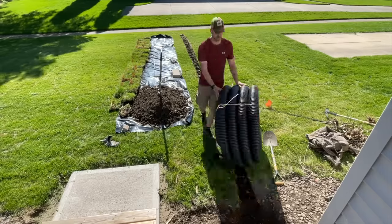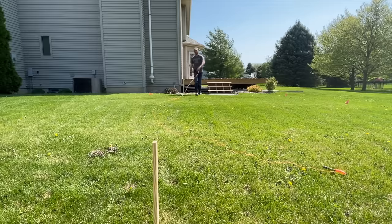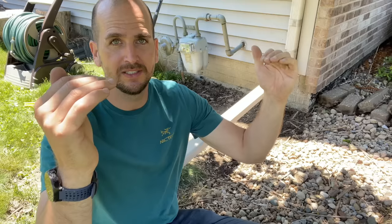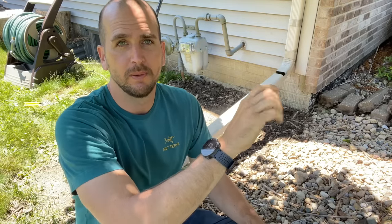For a more permanent long-term solution — option three — you'll need to trench and run either four-inch PVC pipe or four-inch corrugated pipe through a properly dug trench with a nice slope or grade, then discharge the water well away from your home. I have four other videos in a playlist that show you how to understand the elevation change in your yard using a string and bubble level, calculate trench depth, and maintain pipe slope so water keeps velocity and doesn't clog.